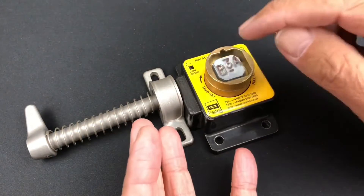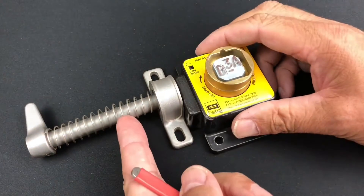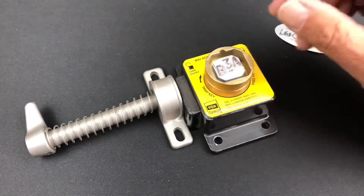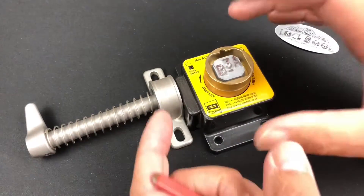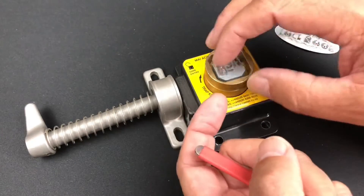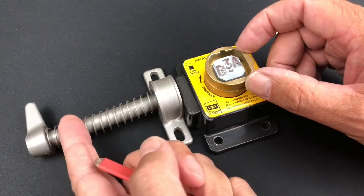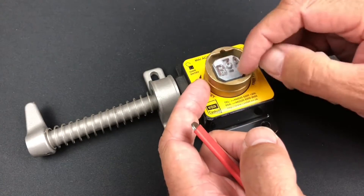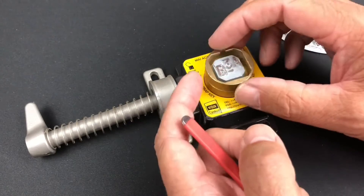It's an absolute complete failsafe - without that key in there you can't open this, and without the power supply unit being turned off and the key in the power supply unit, you can't turn it on. Each part of the production line will have its unique key with its power supply unit and this locking system to get you into the area where the machines are working.